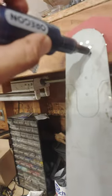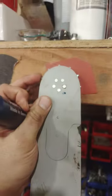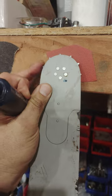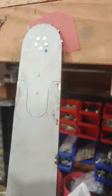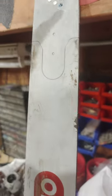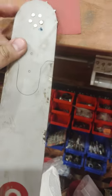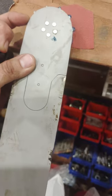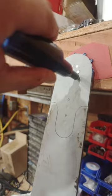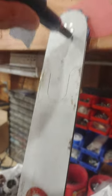All you do is push on this and give it a pump — pump some of the grease in there, then rotate around about an eighth of a turn and get it again. Another eighth of a turn, again. Give it about half a pump each time — you can get crazy with it, you can see the actual grease starts coming out of the end. Just keep going around; that ensures the bearing in there is nice and lubricated next time you go to use it.